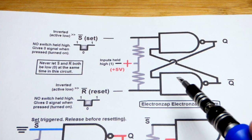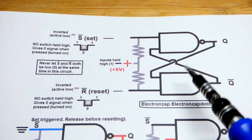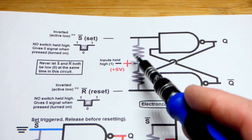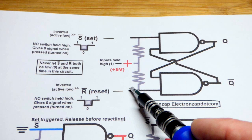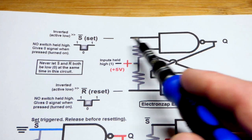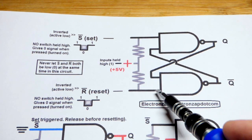In this video, we're going to use two NAND gates. I have an integrated circuit with four of them, but we're going to wire them up like this — not terribly complex. The main thing is each one has an input with a pull-up resistor. We're going to use a jumper — you could also use a mechanical switch — but sometimes you make a direct connection to ground to pull that input low. For the most part, the input is held high with a pull-up resistor.